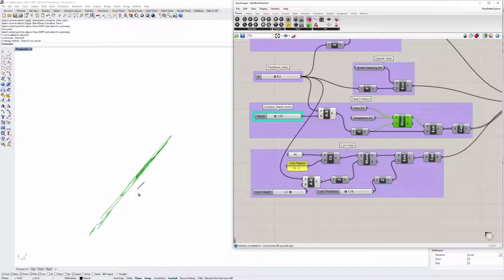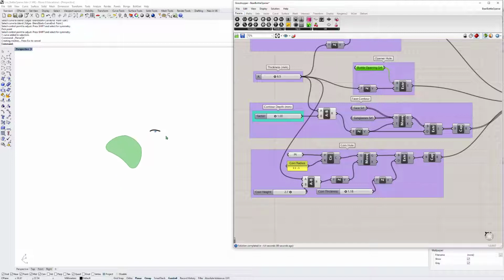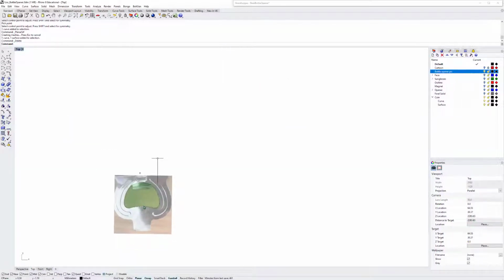You can see this is the base level, and this is where the surface is. I extruded it according to this depth, the same depth that I moved it back, capped it so it'll be a solid, and that's how we got this. Additionally, I didn't say this earlier, I also used the opener hole, which I created as well from a surface. This is from what I did earlier. This is a surface that I created using another picture, a picture of a real bottle opener. I traced it just like I did with the drawing and got the shape that I was looking for.